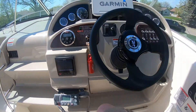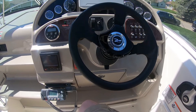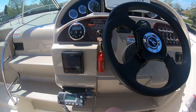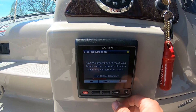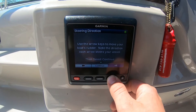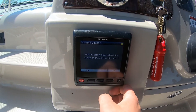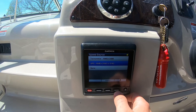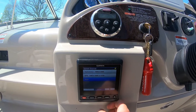To begin the generic drive unit tune, center the rudder using the indicator below. Continue. Now it's tuning — this is 40%, wheel's turning on its own. That says 80% — completed, done. Use the arrow keys to move your boat's rudder and note the direction of each arrow. If I hit right, the wheel turns right; hit left, the wheel turns left. Continue. The arrow keys adjust to the rudder direction — yes it did. Currently we do not have a speed source hooked up; we'll connect that to the Garmin GPS tomorrow and that'll be everything.